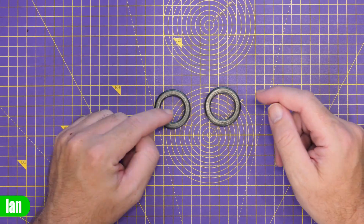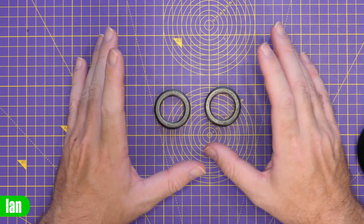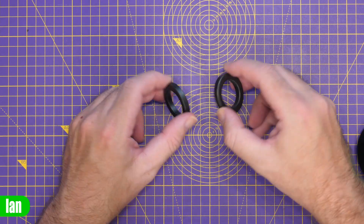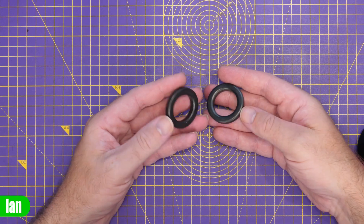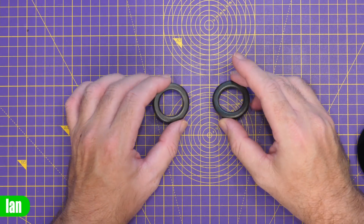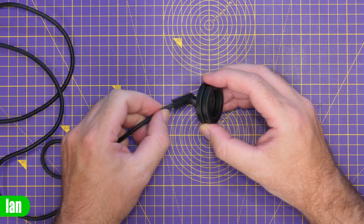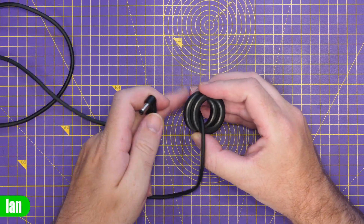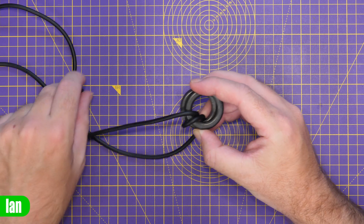To prevent this, we're going to install some ferrite cores or beads on our power cable. There are many different types, sizes, and shapes of these — you can get some nice long barrel ones. I only managed to find two around the workshop, so this is what I'm going to demonstrate with today. I'm going to test it with two of these, but it will work with just one — I have already done the tests on that. What we need to do is take our power cable and wrap it around these two ferrite cores. Ferrite is a bit of a magic material because it tends to do all sorts of things seemingly without doing anything at all.